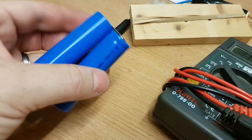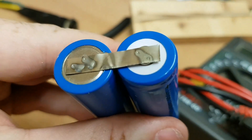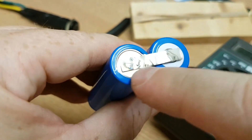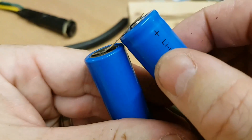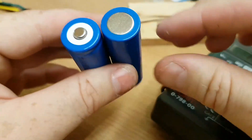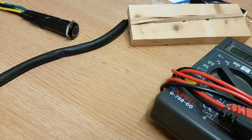I'm pretty stoked with my DIY battery tab welder — not bad at all. I probably could have done with a protector under there just to stop it from melting the covering — the shrink wrap melted a little bit, but not much, it's okay. This is for when I make up my LG HD2s into an 8S4P battery for my longboard, and this tab welder is going to help me do it.